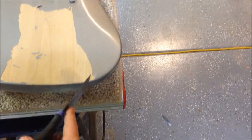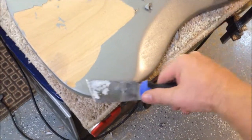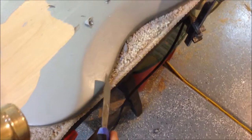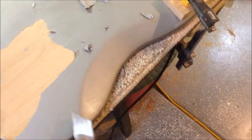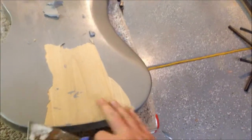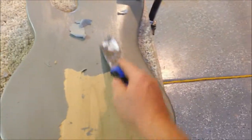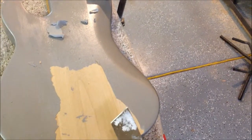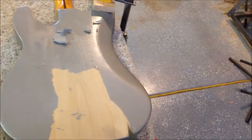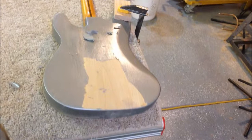Watching the grain, it's easy to catch right underneath it and pull up a chunk. I'll work across the grain so it won't go underneath until I start coming along this side. In this little pocket I'll work carefully because if I try to come around in here, I'll catch underneath the grain and pull up a chunk. This is fairly soft — it looks like alder to me, which is easy to chunk up. With maple it probably wouldn't be such a problem, and ash is probably a little harder and easier to work with.